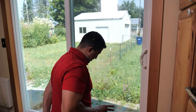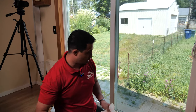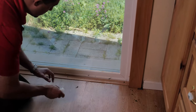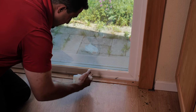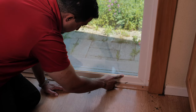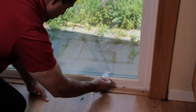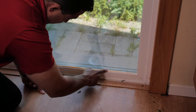One last tip — you can always have a little bit of alcohol on hand. You can always wipe off those edges where a little bit of silicone comes over the edge. What alcohol is going to do is it doesn't allow the silicone to stick to anything else, so you can really easily wipe it off. And that just makes it for a much smoother, cleaner installation.